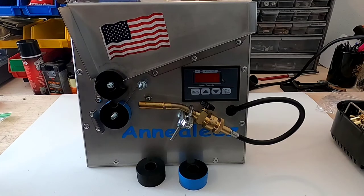Before getting the annealer tuned for this cartridge, I need to change out the feed wheels. The ones currently on the machine are for a smaller cartridge — I had the machine set up for when I was annealing my 224 Valkyrie cartridges. The wheels are just not wide enough from front to back to support the 6.5 Creedmoor cartridge, so if I tried to run it every few would fall off the wheel and not be properly annealed. I'm going to swap those out and then get it tuned properly for the cartridge.